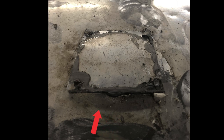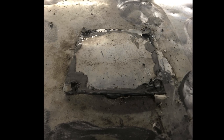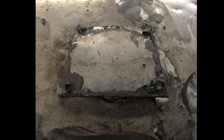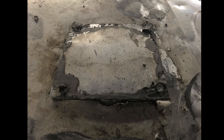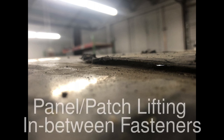There's a huge gap where moisture is going to find its way in. I don't know for sure how well this panel was prepped, but you can see the mark where the sealant was and there's dirt on this roof — it's all been coming apart. I would almost say this was not prepped very well at all; they probably didn't wipe it with isopropyl or some sort of prep-all to clean the grease off. That sealant just cracked right off pretty easily. Bad spacing on the fasteners, and here's a good photo where you can see that tenting where that screw was.